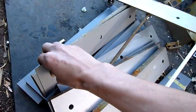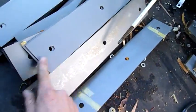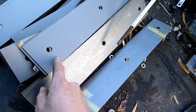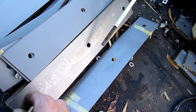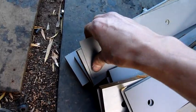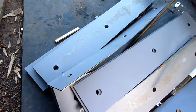Nice laminations — I'll give it that much. Although then again, these shouldn't be conductive with each other; they should be insulated with a lacquer. If they are conductive with each other you end up with core saturation issues, I believe. So they'll have something on them, but I'll see if it performs in the tank.